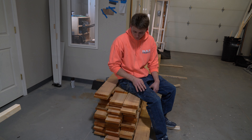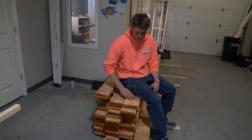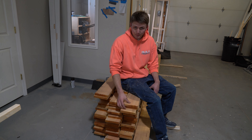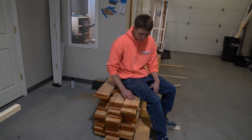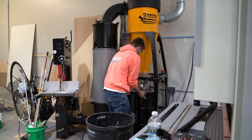The wood I'm making these garage doors out of is clear vertical grain Douglas fir — very nice wood with very tight grain. I've already planed these down; they started around an inch thick and were kind of all over the place. I'm bringing them down to a little over three-quarter inch, and for my stiles and rails I'll be doubling them up to get inch and a half thick. The panels on the inside will be three-quarter inch thick.